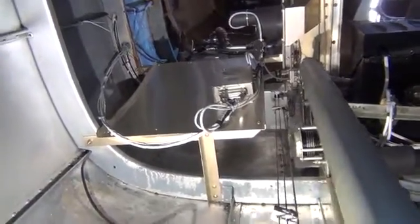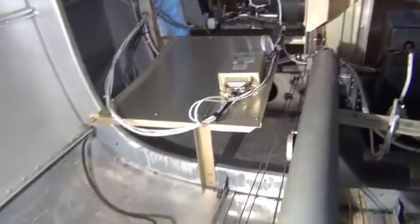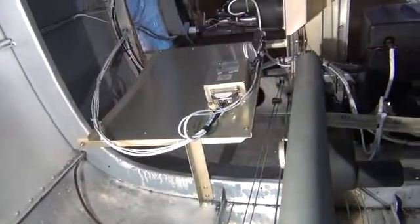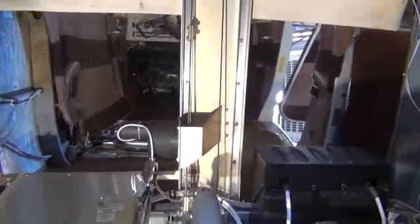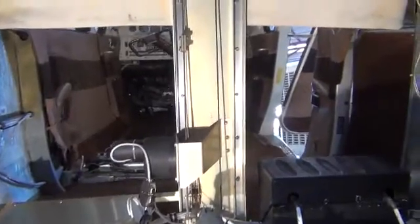Okay, we moved into the aft end of the aircraft here. I can show you some of this. This is the platform that we installed here for the pitch computer. It has to be within plus or minus 10 degrees of level flight. We pretty much got it nailed there. The roll servo is installed on this plate. As you can see, it goes from the top of the baggage closeout down to the bottom.